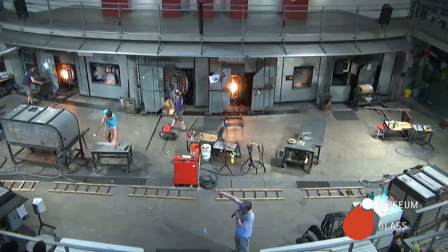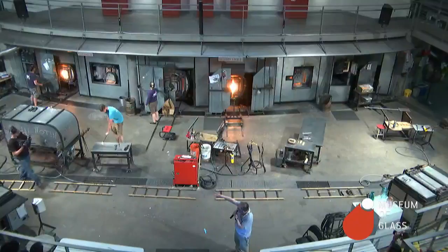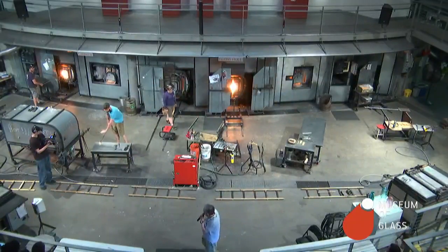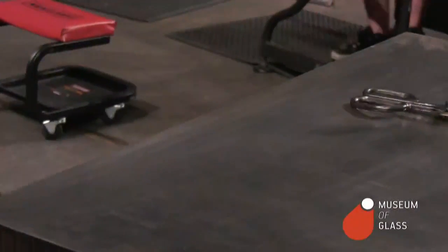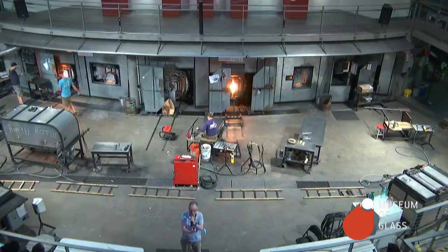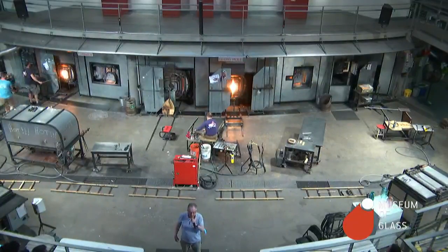honey. So when we want to get the glass out to make stuff, we take one of those steel pipes. We dip the end in the molten glass. You can see the little glowing orb on the end of his pole. That's the hot glass. We roll it on the table. And then we blow just one little puff of air into the tube, close it up with our thumb, and the heat and pressure from the air expands the bubble and blows our first bubble.